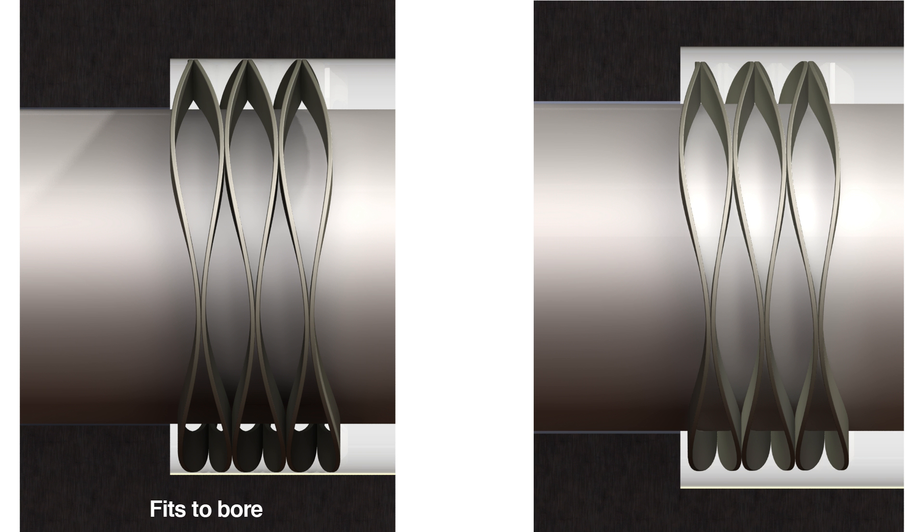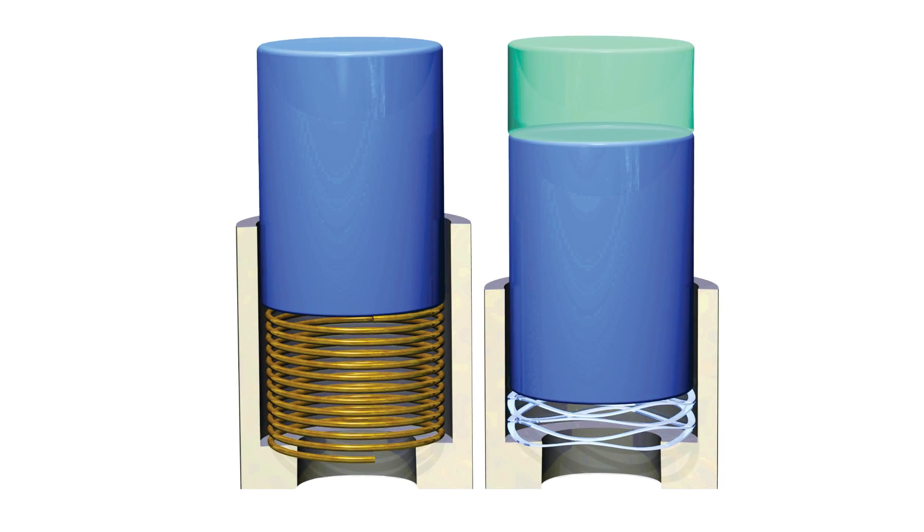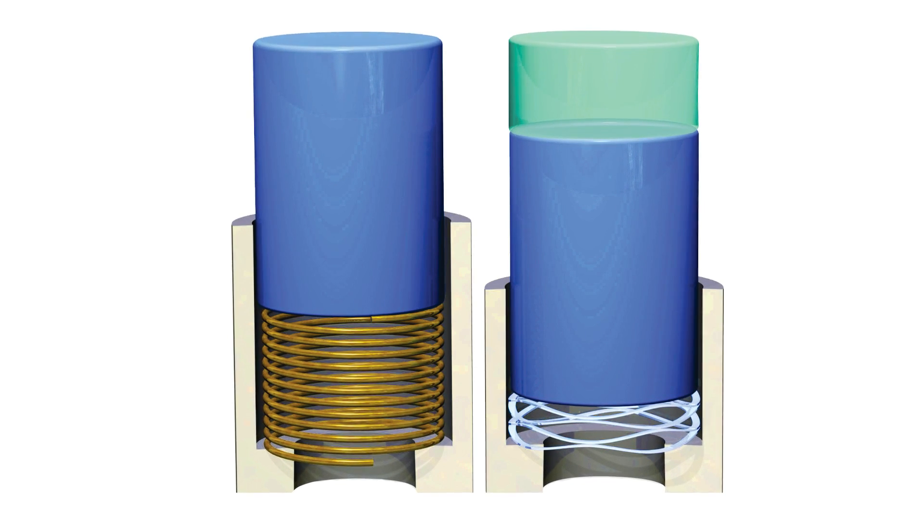You can have it fit to your bore for your assembly, close clinging to a shaft. It could be a progressive spring, or it could have flat ends that are shimmed. Anytime you're trying to save space, a wave spring really comes into play. It really adds that level of design flexibility that you can't get out of a round wire coil spring.